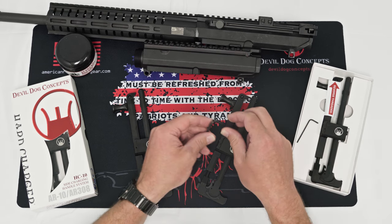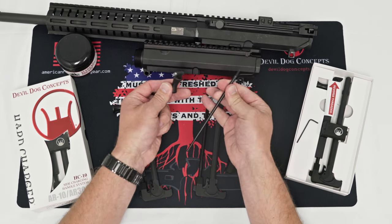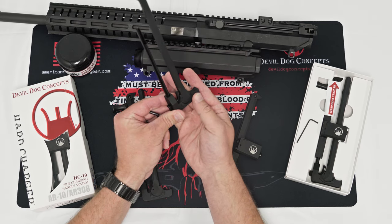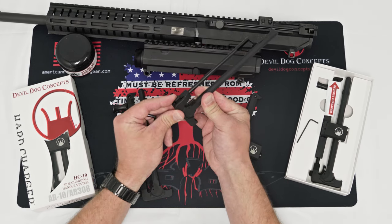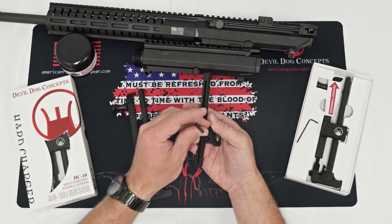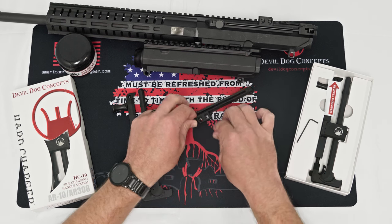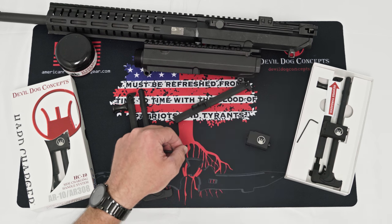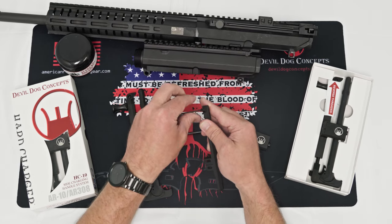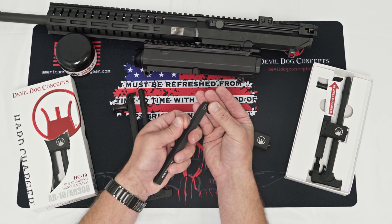Let's break down the parts. Just like the original, you'll have your pull handle and rod, your charging handle with an improved gas deflection or knurled edge for gripping, your protruding release lever, the receiver, and two small receiver bolts. There's also an adjustable tip that is reverse threaded — a small bolt is reverse threaded into a block in the bottom that is roll pinned in.